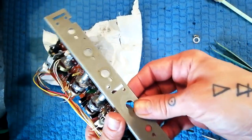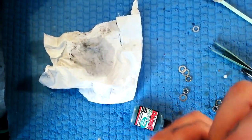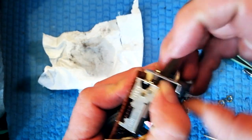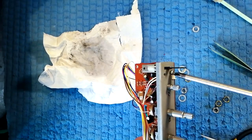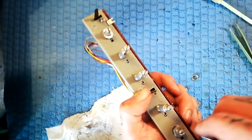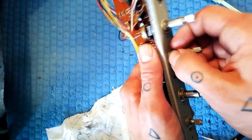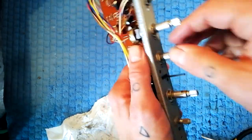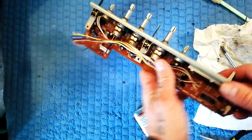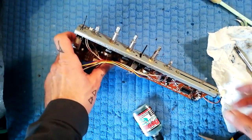Now you can put the front plate back on. To get the plastic spacer back in, have the screw dangling half in, half out and put the spacer over it like so, then line it up and screw it back in. There's a smaller and a larger nut type, corresponding to the different potentiometer sizes — finger tight is probably good enough, with just an extra turn with needle nose pliers. Assuming there's nothing electrically wrong, that channel strip has now been refurbished — or cleaned, anyway.